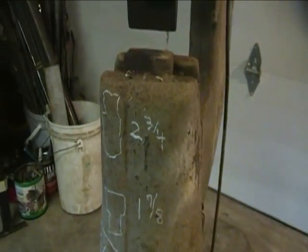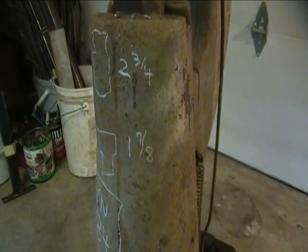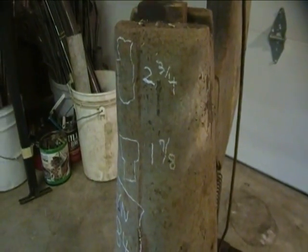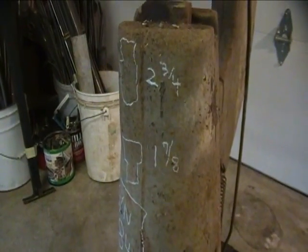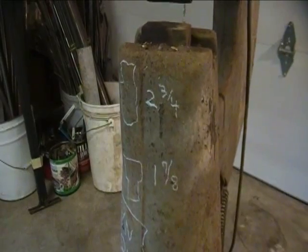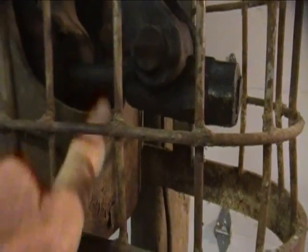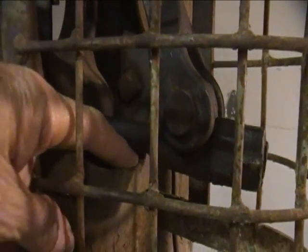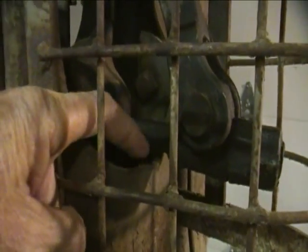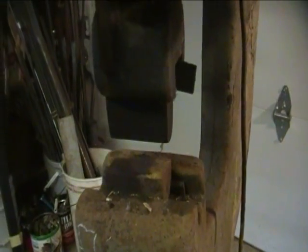On this model of hammer, the height of the two dies is supposed to be three inches each. I measured these: the top one is two and three-quarters, the bottom one is only one and seven-eighths. Three plus three is six, and it's getting pretty short. Any shorter and the toggle length here would be hitting — in fact I think it's just touched the wraparound guide just barely — so this set of dies shouldn't really be used anymore, especially with nothing in between them.